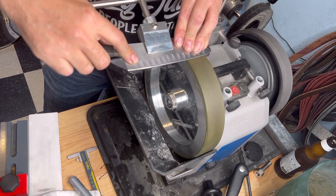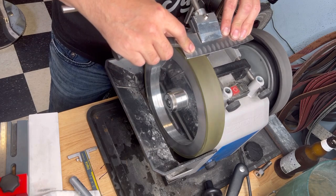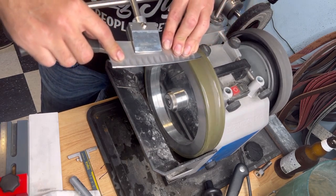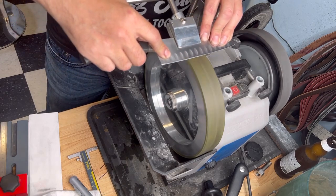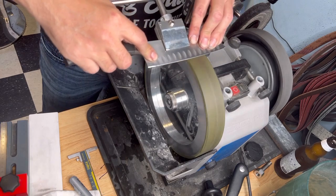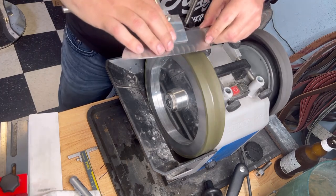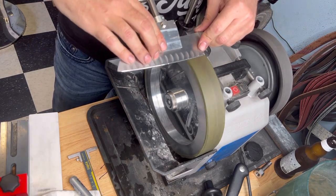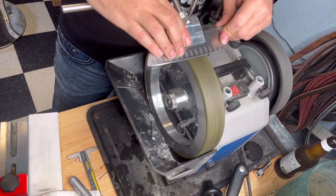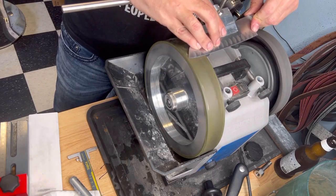Well, and this is polishing, I can go like this. 4 or 5 times, change direction. No problem. Again. And you can polish as long as you want, or as long as necessary, because you don't remove any material, you remove scratches. Well, actually, when you're removing a scratch, you're removing a tiny little bit of material. Yeah, sure. But it's not something that is going to make your knife smaller.